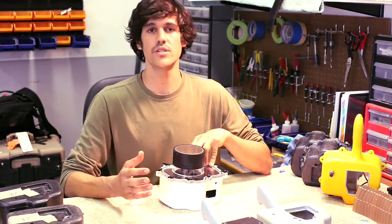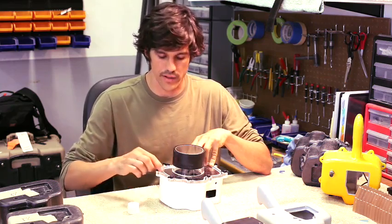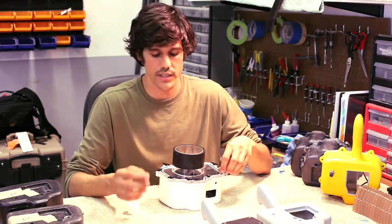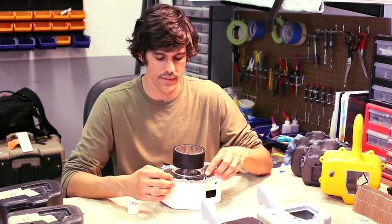Depending on how much you shoot, every week, every month, you might need to dab a little bit extra on to keep your O-ring slippery. And depending on if you shoot reef breaks or beach breaks, you do want to keep your O-ring groove very clean. From time to time, you can remove the O-ring, clean the groove out with a Q-tip, make sure it's all free of sand and debris, and you'll be all ready to go and have years of happy shooting.